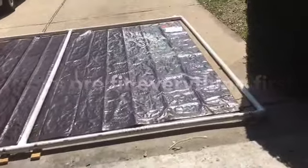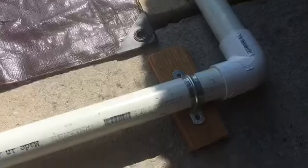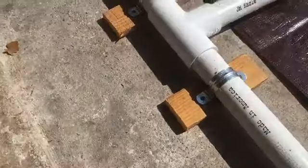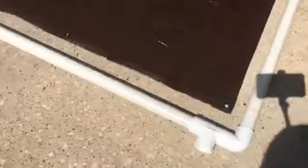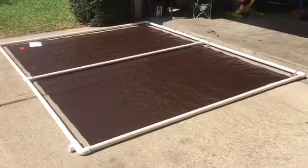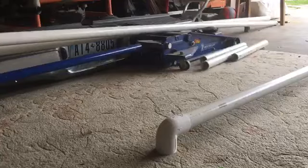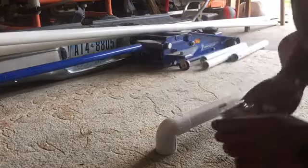I got three eight-and-a-half inch center pipes. Alright guys, I'm done with the cutting. This is pretty much how it's gonna look when it's all done on the wall — elbows, wall mounts, the wood spacer, wall mounts, T-connector, elbow, wall mount spacer. I had to cut four inches off this pipe because we added the connector. It's my first time doing this, but I'm pretty happy with it.